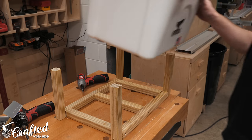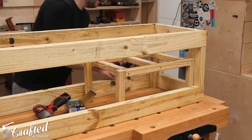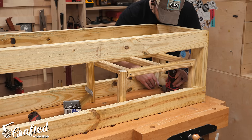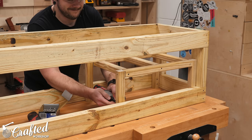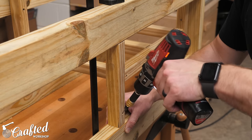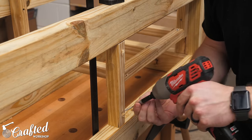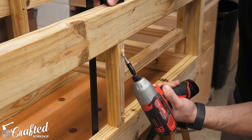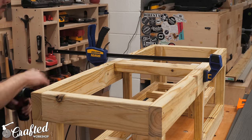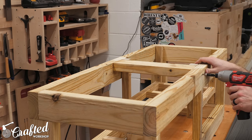After adding the uprights, I did a quick test fit with the Orca 20-quart cooler to make sure it fit, and it did. Next, I flipped the cooler support upside down and dropped it into one end of the 2x4 frame, then drove two screws through each upright into the 2x4 frame. I needed something for the boards to attach to on the center of the front of the patio cooler, so I added another 2x2 upright to the center using the angled screw method. I also needed one more board in the center of the top to provide some more support once the hole for the cooler was cut out, so I cut a piece of 2x4 to length and added it with a few screws.